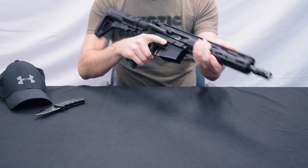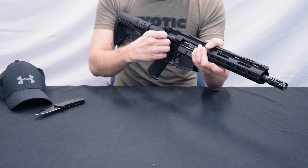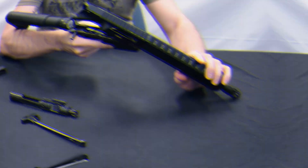Magazine well is standard — all the standard AR-15 magazines fit: 30, 20, 10 rounds. Let's briefly take a look inside. We have the two takedown pins, AR-15 standard. Let's open it up and see what I find. Here is the bolt carrier with charging handle. Then we have the upper and the lower. That's already quite interesting mechanically — I'll try to get you some close-up pictures. They have a relatively narrow hammer, I must say.